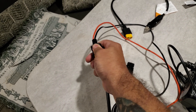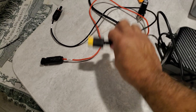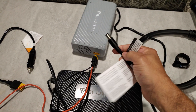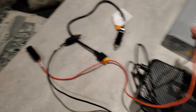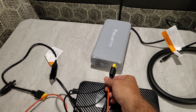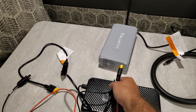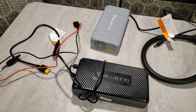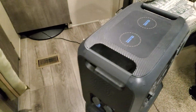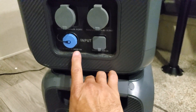This is the DC enhancer that everybody's talking about. You hook your solar up to the DC enhancer, and then the DC enhancer plugs into where your grid input would go. That way you'll get that extra — hopefully — 500 watts. The average I've been seeing in videos is between 385 and 410 watts; if you have video showing the full 500, tag me. You can have solar coming in from the DC enhancer into the grid port and also solar coming in through the standard solar input.